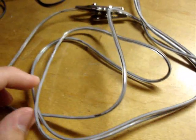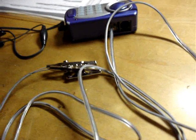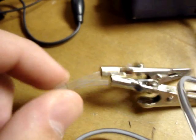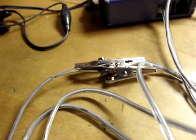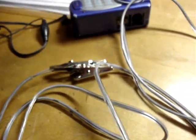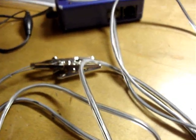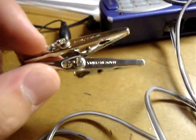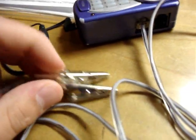These telephone cables often have a red and green wire instead of just two gray wires, and oftentimes they have four instead of two wires. If yours has four, the only ones you need are the red and green ones. Mine had two gray wires — apparently this is the way they're making them these days. Usually you match the red and green wires up with the corresponding red and green wires, which are ring and tip respectively, on the telephone network interface. But with mine, I found out it works either way.